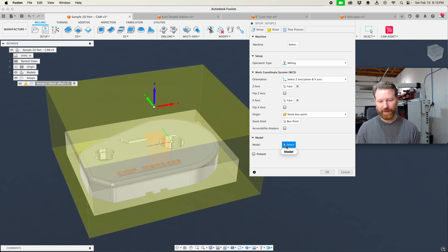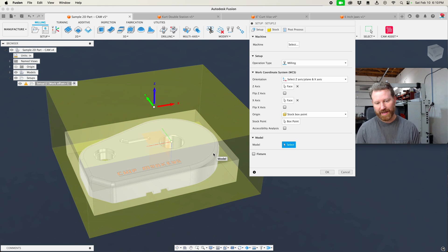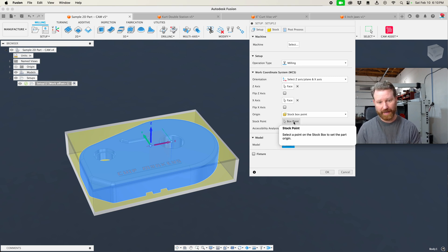Now our body — we can select this. You can say oh, that's my stock, but as I take my mouse and move it over, I'm able to select my body through the stock when it gets to a piece of geometry associated with that 3D model. Now I can control where my stock point zero will be. If I select this I can select this corner, this corner, this corner, this corner. I'm going to put it in the center so if that stock changes, I have the best chance of getting that part machined. Notice that it's not taking any consideration of the stock — that's because it's on the next tab.